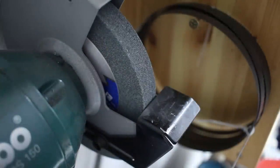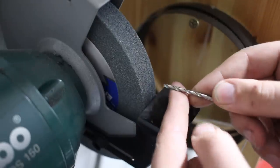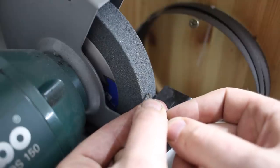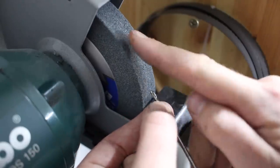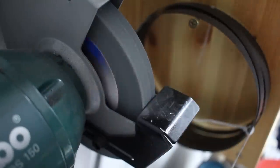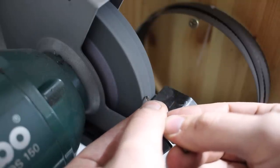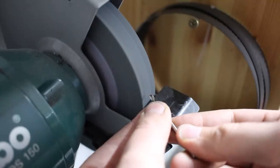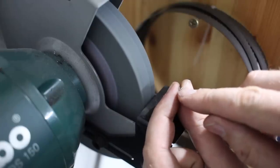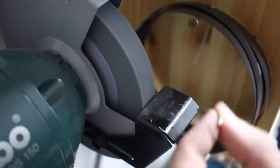This is not going to be a drill grinding video, but I'm going to show you how I grind the drill. With this relatively small drill, I come in approximately at the angle of the tip, make contact with the wheel, then tip it back and push it forward at the same time. I do not do the rolling motion. I do this to one flute, then spin it 180 degrees to the other. I check that both cutting edges are reasonably the same size — if so, I call it good.